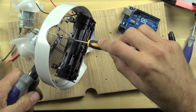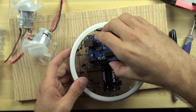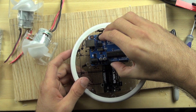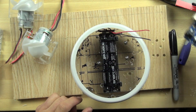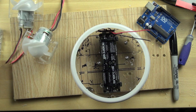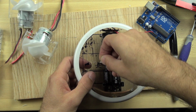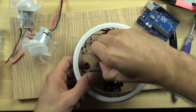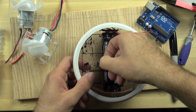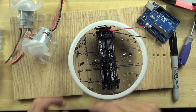So now we're going to see if the Arduino fits — yes, it does. We want to make sure we mount the Arduino high enough to still access the USB port. To do that, we'll take some of the same nuts we used for the machine screws and set them at a height on the screws to hold the Arduino up at the right level.